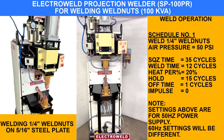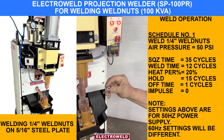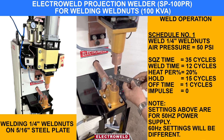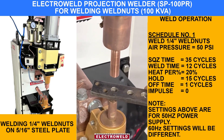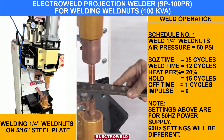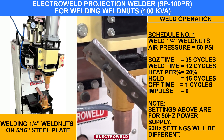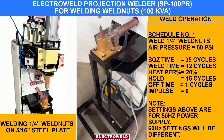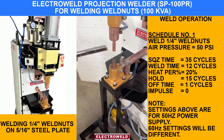Now we will show you the working and welding of the nuts. This is a quarter-inch nut. You can keep it over here on top, you can put this, then you can press the foot switch. See, this is how it is welded. This is a 5mm thick plate. We will show you once again the welding of a quarter-inch nut with a 5mm thick plate.